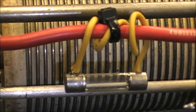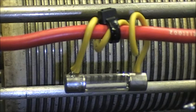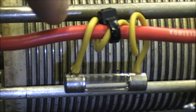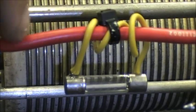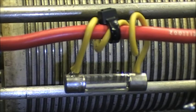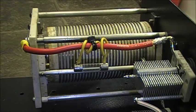One thing you might have noticed is what looks like a fuse — it's actually a bulb. You see them sometimes on old radios behind the S meters; it's shaped like a fuse but it's actually a bulb. All it is, is just a piece of wire connecting one end to the other, wrapped around the red wire. Basically it's just an RF indicator. It just picks up RF and lights up. Depending on how close I move it along the red wire, if I move it to the left the bulb won't light, but if I move it to the center of the red wire it will light up — it gets resonant. Just an RF indicator.